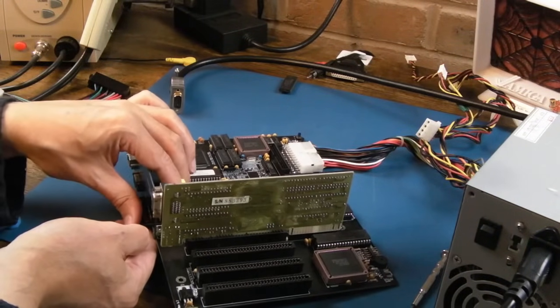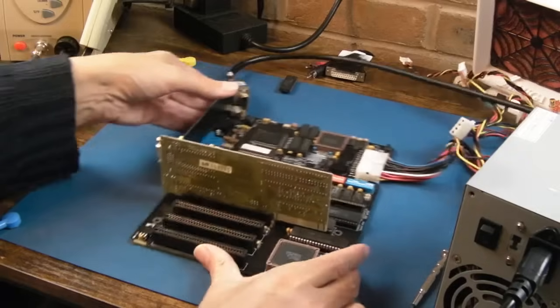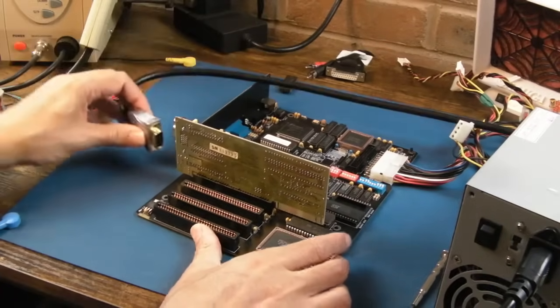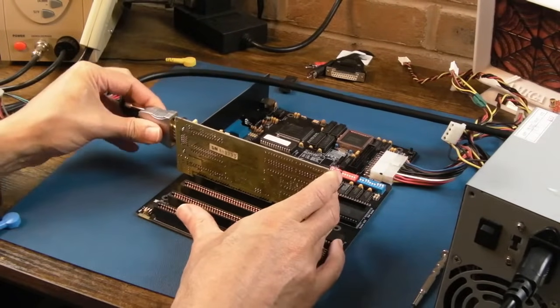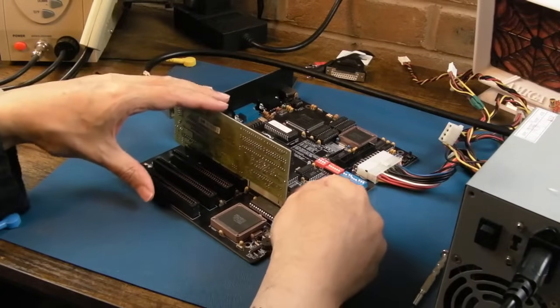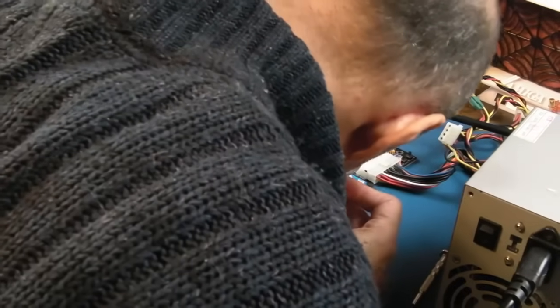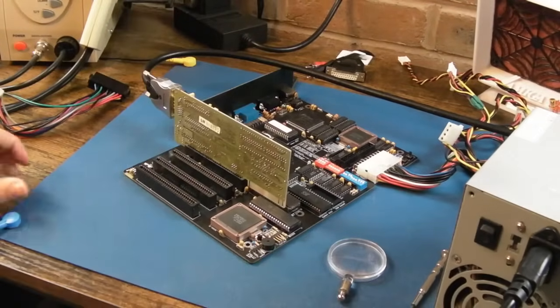Yeah, that's going in. So I've got a compact flash card there now. Let's see what happens with that. Is it going to auto boot? Again, just being careful to make sure that these pins here do not short onto the side of that chip. Yeah, there's a gap of about 2mm, so anyway, let's power that on. Now I'd like to hope it's using like the XT-IDE BIOS or something similar, whereby switching it on, it'll auto detect that compact flash card maybe.